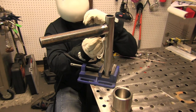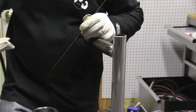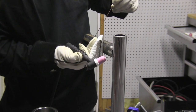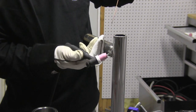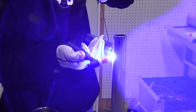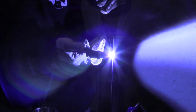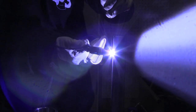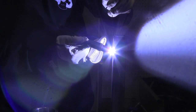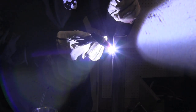There's another clip coming where we can see it better. I'm holding the torch still while I add rod, moving forward somewhere between one sixteenth and an eighth of an inch, about once a second — one dip per second. I'm going to twist that torch every time I add rod, turning it between my thumb and forefinger just a little bit so that my torch angle stays where it should be and doesn't lean back way too far. Every time I dip the rod and move the torch ahead, I'm spinning that torch handle just a little bit and it maintains a decent angle.